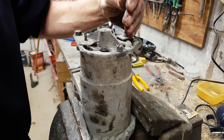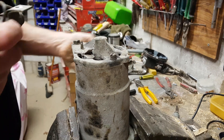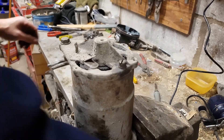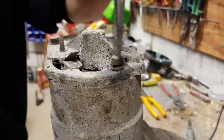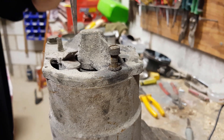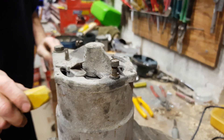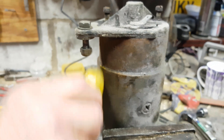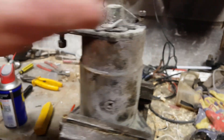We want to get that one off first - that's a capacitor for a radio, for stopping crackling. It sort of takes out that crackle. Now, how long has that been since it came to pieces? This was off an escort engine. What I'm going to do here is mark which side that goes, because you can put them back together either way - they're left or right hand on the engine.